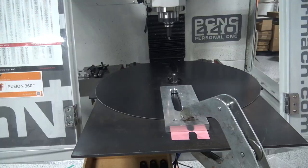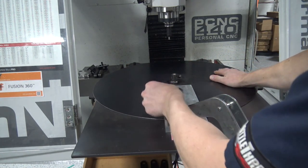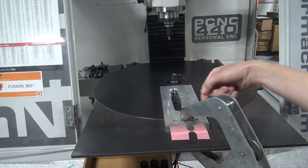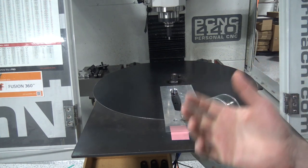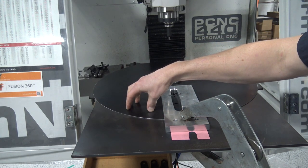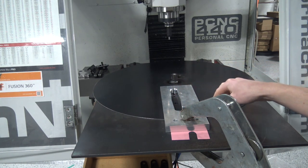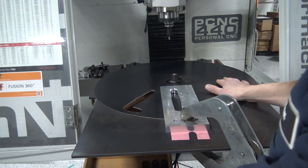Here's what I love about this — the Arduino code is so simple. How does it work? When you turn the machine on, you rotate it by hand to the spot where a clamp drops in. Then when you plug the Arduino in, it knows you're at home position. Home position is zero. It's 8,000 steps of the ClearPath motor to make one revolution, and it's a servo, so we have accurate control. We go to 4,000 at full speed, come back, slow down near the drop area, then come to slightly before 8,000 and go to a slower feed rate — that's what helps us pick up the station correctly. Then we get back to a little clear interior and whip it back around. I'll do it right now again to prove it.